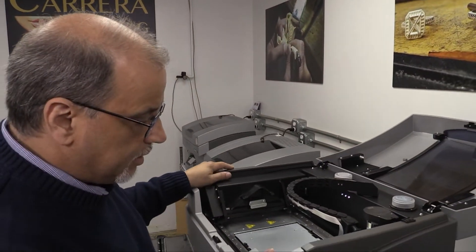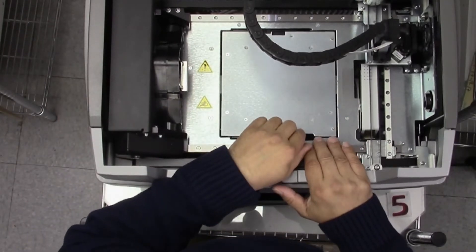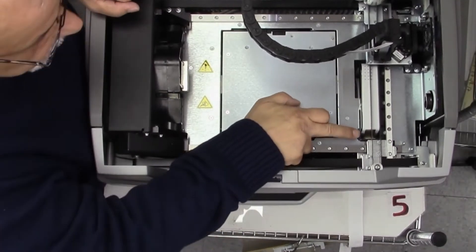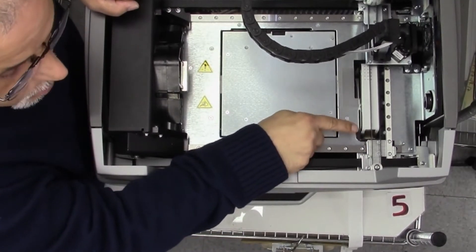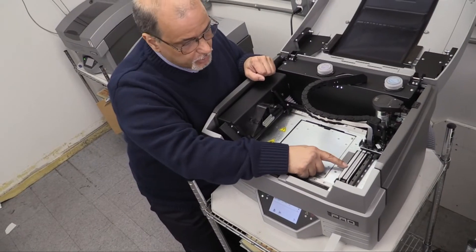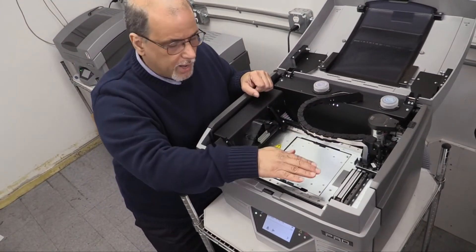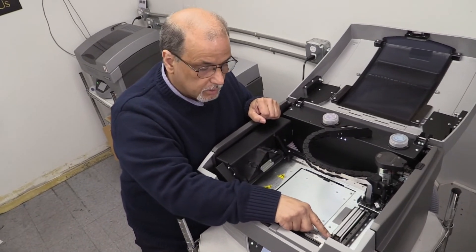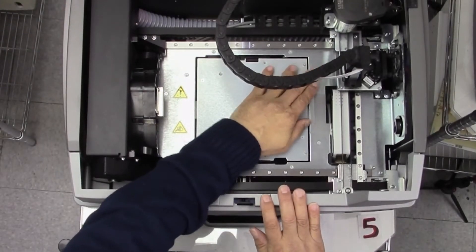Another very important thing is your tape. If your tape is not aligned correctly, or if the tension bar — which is right here, it looks like a little bent piece of metal right at this spot — if that's loose, this tape will not function properly. There needs to be tension there. If you see this tape has a little rise on it like a little wave, that's no good. This is the spot you have to check right here where the tension bar is. It should be lying nice and flat — that's the way it should be.